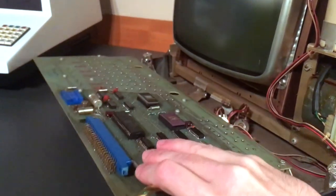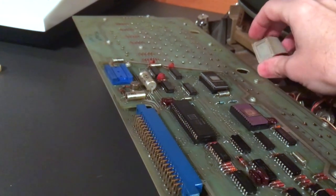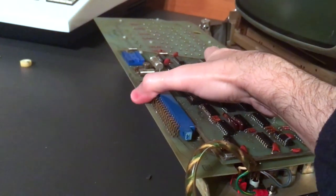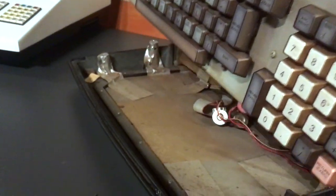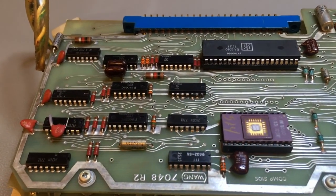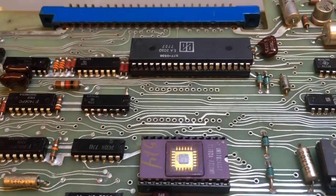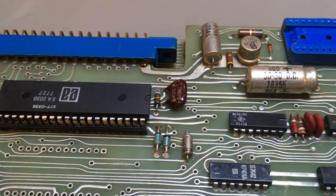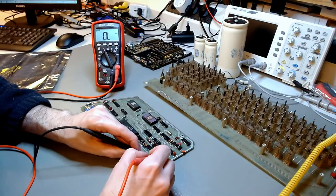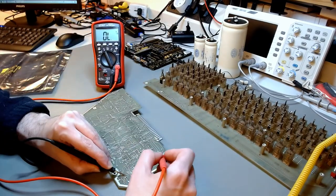This brings our attention to the keyboard. Underneath the keyboard there is a digital board that connects to the rest of the system via an edge connector. I didn't have the opportunity to test the keyboard because the computer didn't boot. There are a few high-voltage IC drivers, a flip-flop chip, and that large EA chip — a custom chip made for Wang — which is a keyboard matrix decoder. There are also two ROMs. Based on the schematics, I started studying the design to develop a plan of attack for refurbishment.